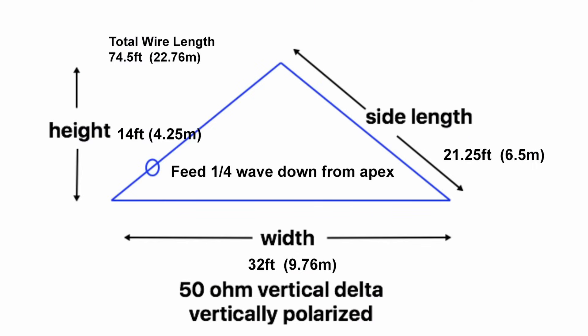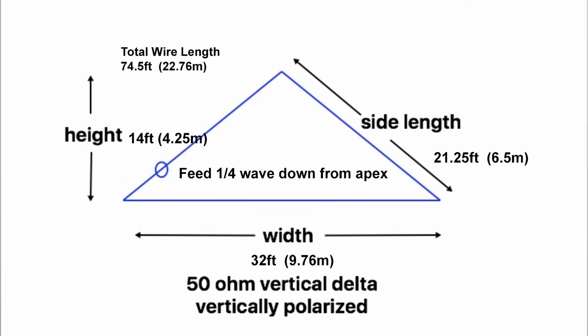I've put up on the screen the drawing of this antenna. You can see it's like a diamond antenna — interestingly, it's fed on one side, fairly low to the bottom, which means it's vertically polarized. The dimensions are based on the antenna base being 10 feet above the ground — not terribly high, so it's clear of people walking around and not difficult to support on a vertical mast. I've given the dimensions for 14 MHz (the 20-meter band), but dimensions for other frequencies are available via the link below. The antenna is bi-directional, radiating at 90 degrees to the run of the wire, giving it some gain over an omnidirectional vertical.